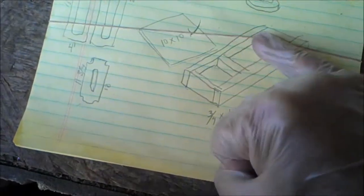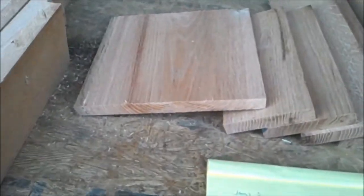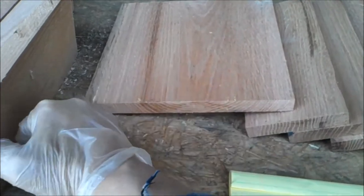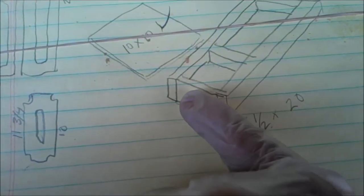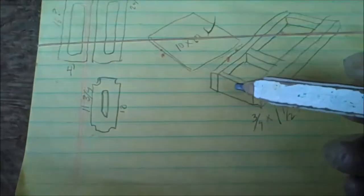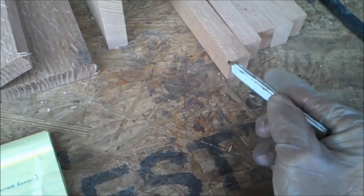We got two of these and two of these long ones. This turned out to be — let's talk about dimensions. These were planed down to seven-eighths, they're actually pretty thick, and they're 1.5 inches wide. These are 24 inches long — I went ahead and made them 24 to give us a little more leverage out there on the end. So we've got two of the outside pieces and three braces. The length of these I measured by putting two of these boards onto my board and marking to what it wants to be to match the width of this, since it's not exactly 10 inches — that doesn't really matter.